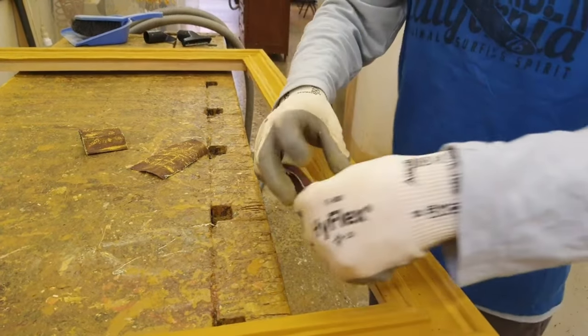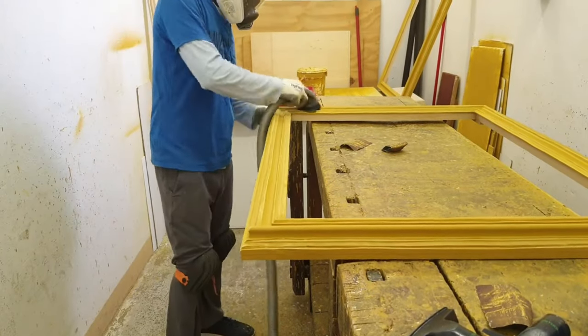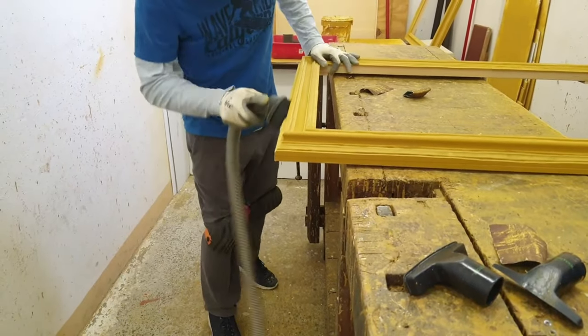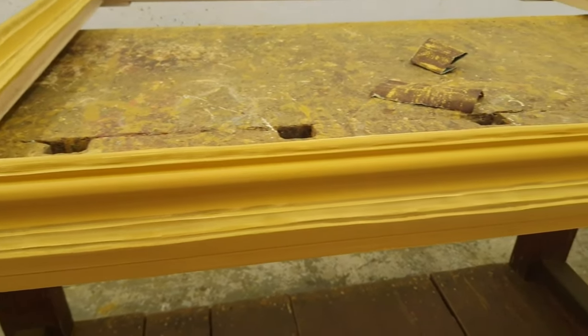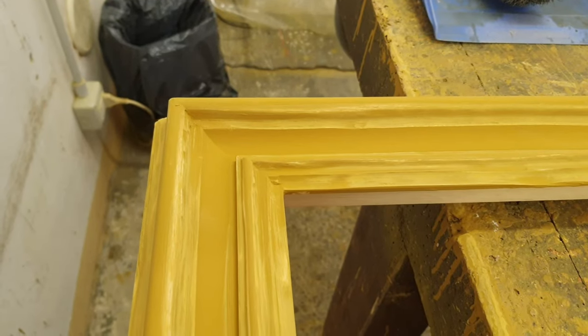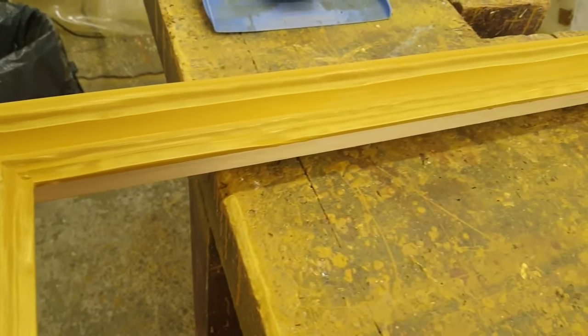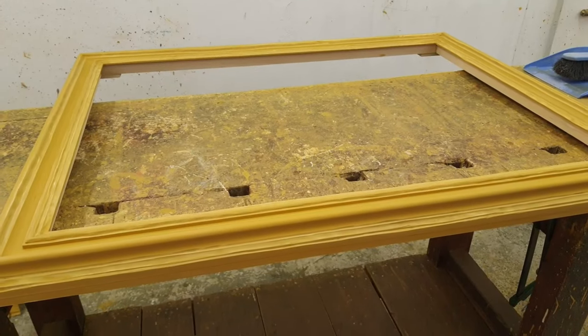Generally, it is a matter of 5 coats of gesso for each frame. The final result will be a well-smooth profile made of the typical undulations of hand-carved wood. Basically, skillful undulation and good smoothing are the two fundamental requisites that characterize high-quality replica frames.